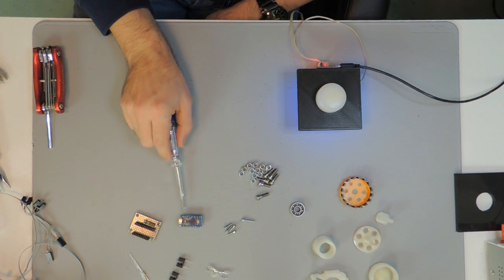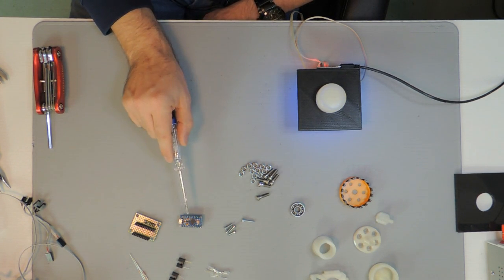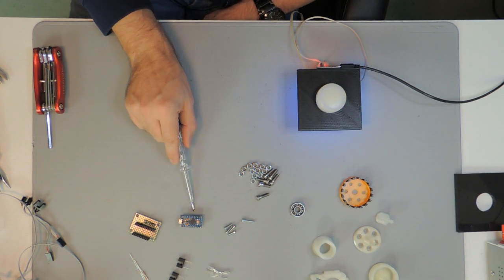Furthermore, we need some kind of microcontroller to control all that stuff. What we use here is a so-called Arduino Pro Micro. It is, from my point of view, absolutely perfect for that purpose, as it is very small. It has capabilities to act as a USB mouse. Once it is programmed, it will be automatically recognized by each operating system that supports USB mouse.